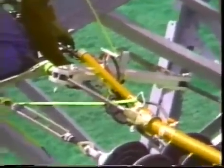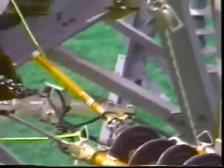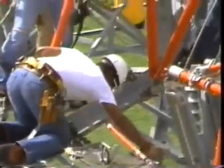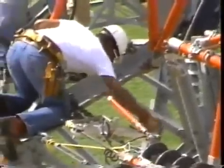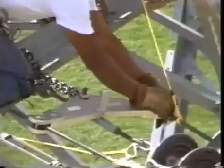The cradle now aligns the cold end of the string and it's reconnected. The ratchet wrench relieves tension on the strain poles and the static ground is removed from the cold end and lowered to the ground.